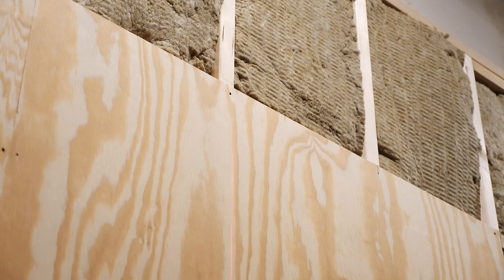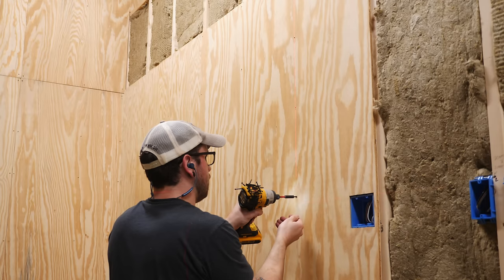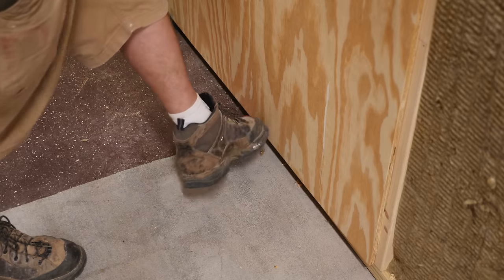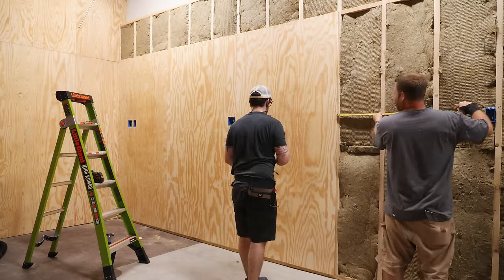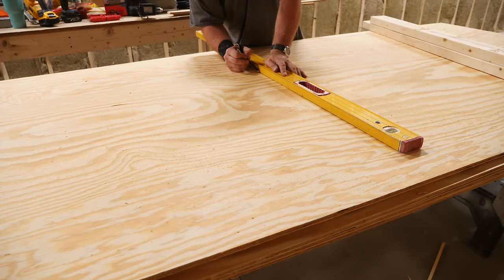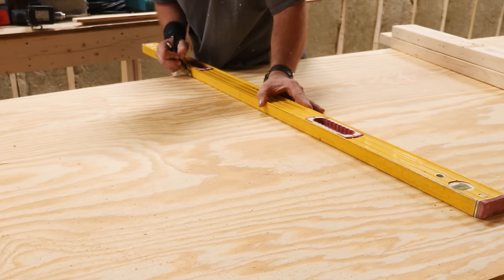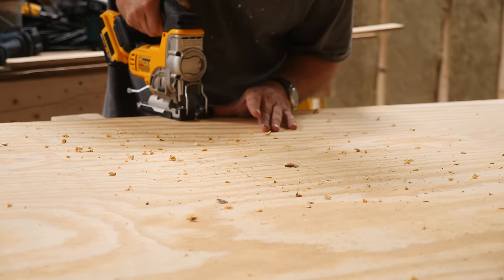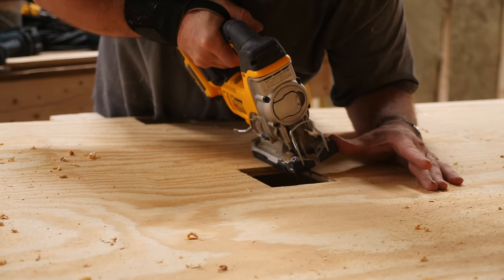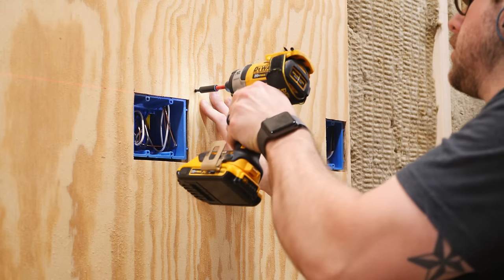One quick tip: I found the laser was easier to see if I set it up a few feet off the floor on a ladder, as that made it brighter at the top of the panel so the line could be seen even under the bright shop lights. Here's a close-up of that roll lifter — incredibly useful during this whole process. For cutting around outlet boxes, Justin would take measurements referencing off of the previous panel and lay them out using his level and speed square as straight edges. Since we mounted the electrical boxes using the line laser, we knew they were level, so Justin could extend the horizontal lines for both boxes. He drilled a starter hole with a spade bit, then cut out the opening with the jigsaw. The big trick I picked up was to undercut the openings by angling the jigsaw, which made lining up the electrical box with the cutout much easier while still keeping a nice, tidy reveal around the box.